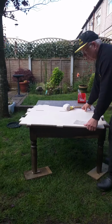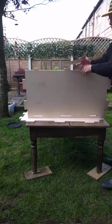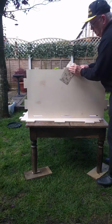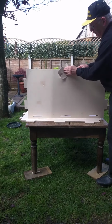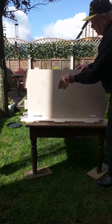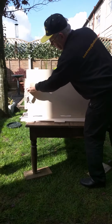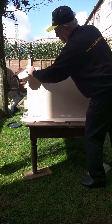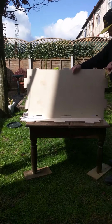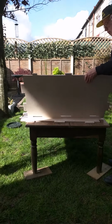And the most important thing with this is that you just gently sand all corners when you get it, because there may be flash on the edges and you don't want them to catch as they're going in. A lot of holes won't be showing, but that doesn't really matter. You just gently sand all mating surfaces, and then that should be okay.